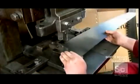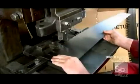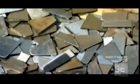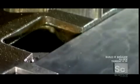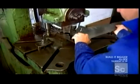Using a punch cutter, the worker carves gullets in the steel. These are the valleys between saw teeth through which sawdust and debris are cleared. He cuts 1 gullet every inch. He then cuts the teeth, 3 between each gullet.